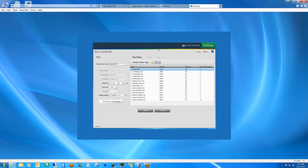You don't ever plan to incorporate all this as part of an add-on profile inside of Logix, do you? Where you just drop it in? Yeah, that's been discussed. We would have to change it so that it would support a Class 1 connection, but that's absolutely doable. Basically, the comms module is a Linux computer, so we can definitely add that capability as we go forward. As it stands today, we don't have that capability, but that's something we could add in the future.